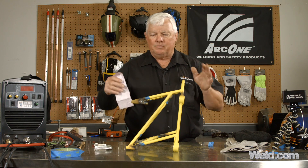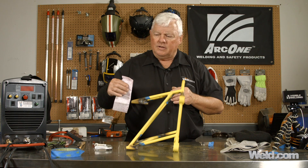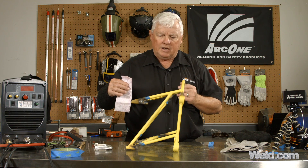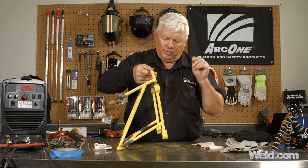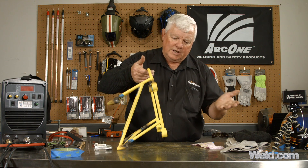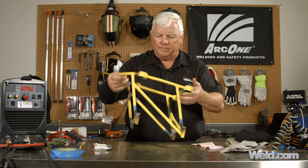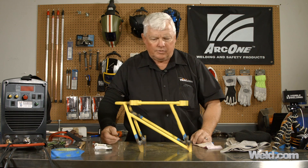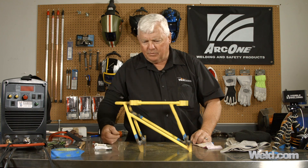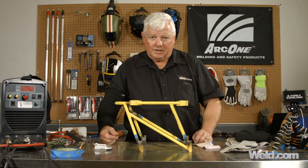So this thing is going to have to be re-stripped or sandblasted and then re-primed and repainted. I used a 1/16th pointed tungsten DC, and most of the welding was done in less than 40 amps — pretty normal for aircraft type components. This is going to go back to its owner in Florida, we'll ship it tomorrow. Thank you for watching us on TIG time, I'm Mr. TIG.